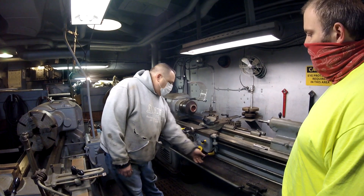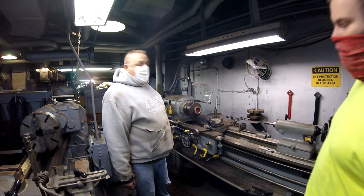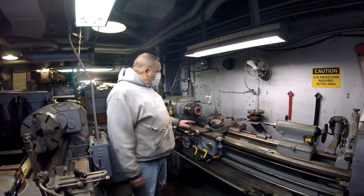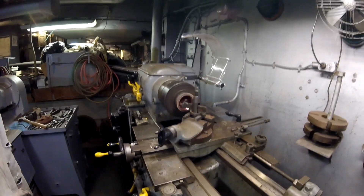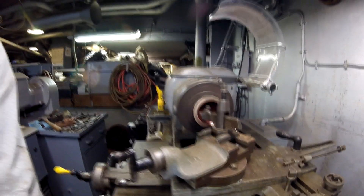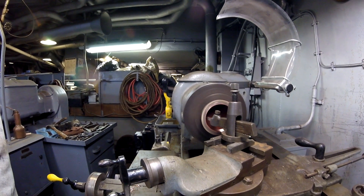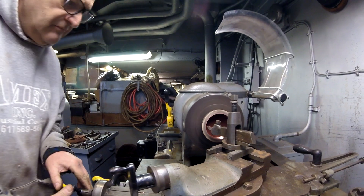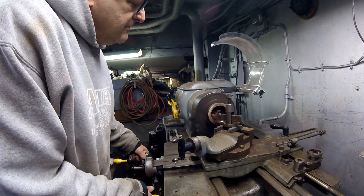What type of materials could this cut? Right now I'm machining brass, but I've done aluminum on this lathe. I've done steel, I've done stainless steel. It all depends on how you shape your cutter and how hard the stock is. You got to work it out. I think I went the wrong way with the cutter — this should be the correct way.